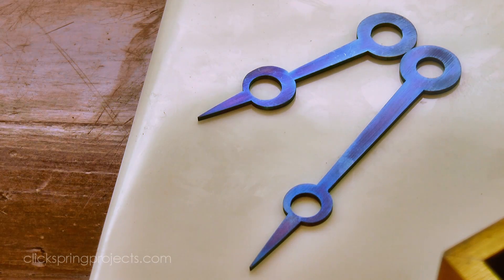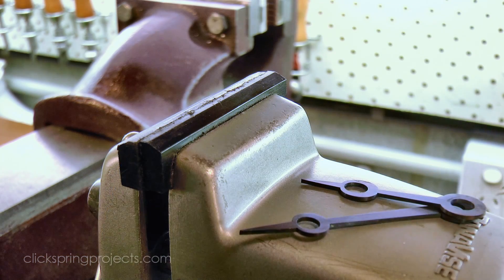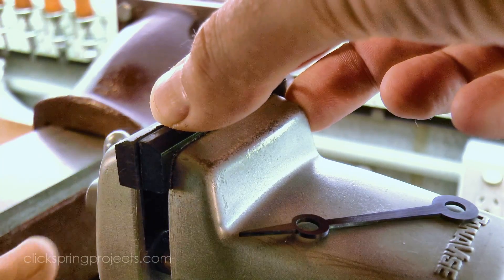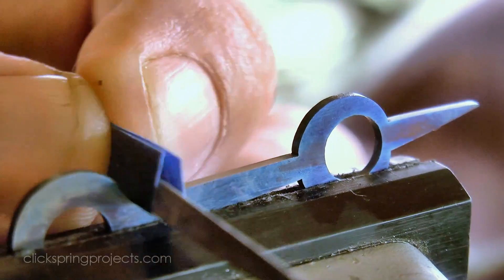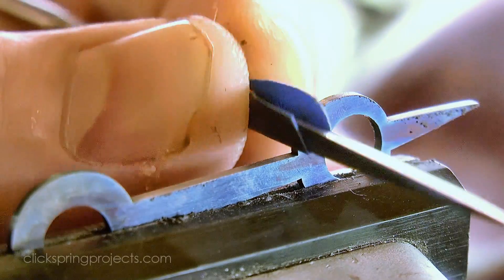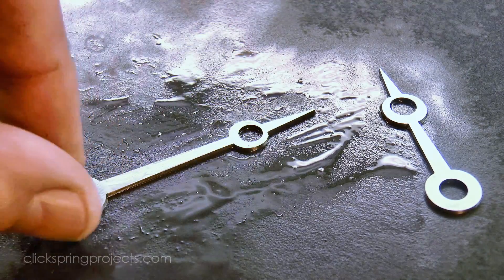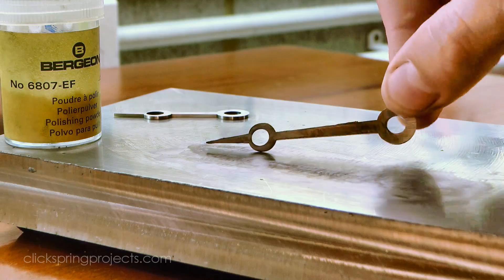So the hands have been tempered from full hard to blue, and are ready to be polished. There are many different ways to go about doing this — I'm going to use abrasive paper for most of the initial work, but I could just as easily have chosen to use abrasive stones, or perhaps diamond paste on polishes instead. The main thing I'm keeping in mind is to try to maintain the crisp edges and to avoid rounding the flat surfaces. When working on the broader surfaces, I'm trying to keep the movements reasonably short with an even pressure. The final surface finish comes from using diamantine powder on a tin lap, again with short moves to maintain the flat surfaces.